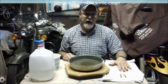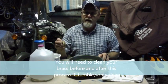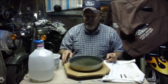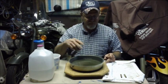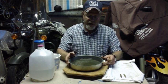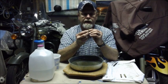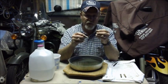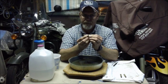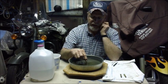I've got just an old cotton rag here. This brass has been fired eight times and has not been annealed before. We've got a lazy Susan here — it used to be a spice lazy Susan with a nice little ball bearing turntable. I also have an old round skillet with water in it. To properly anneal brass, you need to leave one inch of the brass out of the water. This is just plain tap water — you don't need distilled water. The 223 case is one and three-quarter inches long, so I've got three-quarter inch of water in the pan.